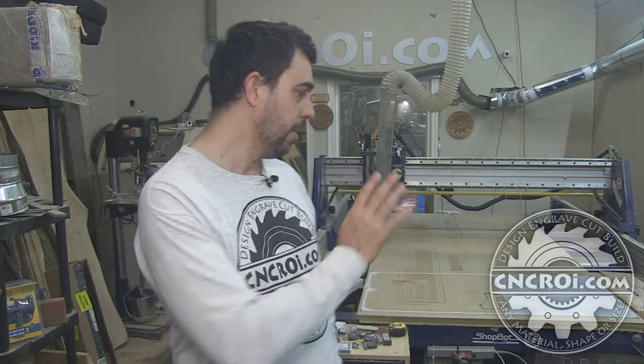We have different machines that can do different things on the polycarbonate. The major advantage of the laser is that we can make very, very fine holes. The disadvantage is anything over about 0.02 inches thick — we really can't do it with the laser because polycarbonate holds heat from the cutting process, getting hotter and hotter until it starts to warp. With the router, we can basically do any thickness, but we are limited by the bit diameter. With the water jet, you get the benefit of both: very small holes and very thick polycarbonate. The disadvantage is that it's a wet process — the sand and grit goes everywhere and can scratch the surface, which the router doesn't do, and the laser can't do because it never actually touches the material.